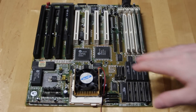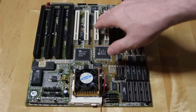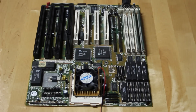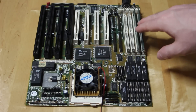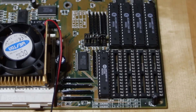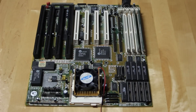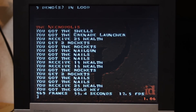Where to from here? Some of you are wondering about 150 MHz - it's a slower CPU speed, but you get a faster frontside bus at 50 instead of 40. I tried it out and got 16.7 frames per second, mainly because I had to add an additional wait state to keep the cache stable. We also tried EDO RAM instead of fast page memory, but it didn't make any difference to the scores either way. So what I'm going to do now is add more cache - this board will support up to 512 kilobytes, and this might actually be the first board on the channel that actually works at the full 512. I don't believe it - I was wrong, it's actually faster: 17.5 frames per second, another record. I just don't believe this board. It's amazing.